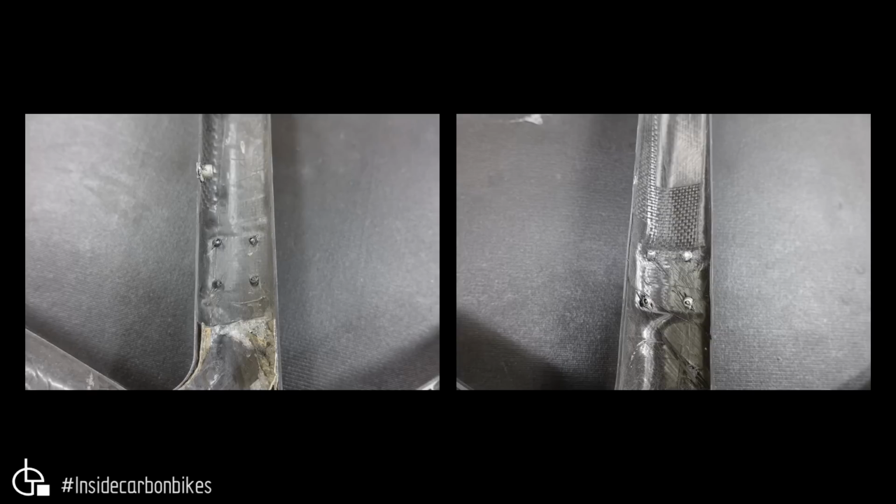You can see even on the genuine, there is some splintering of the fibers. That's obviously a 45 uni, and when it was drilled, there was some splintering there. Here you can see that residue that was left in from the bag, the EPS molding system.